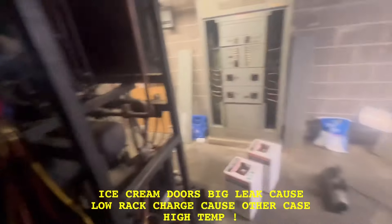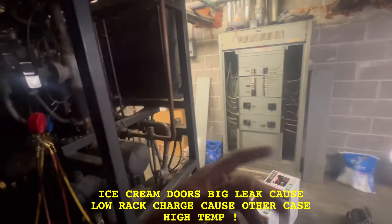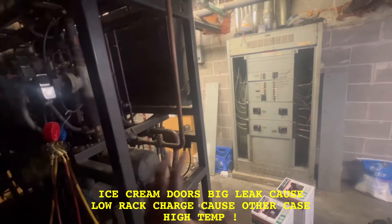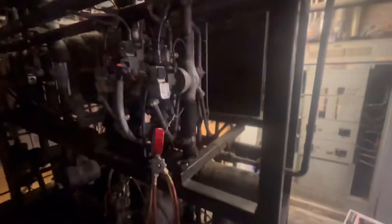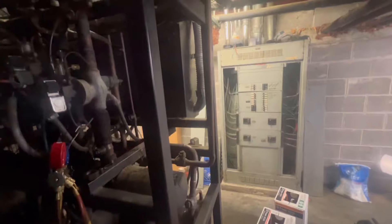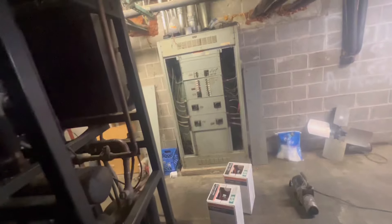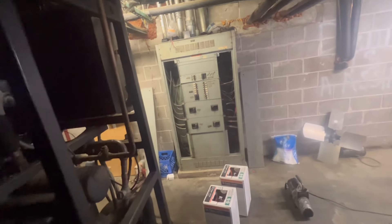I charged my phone temporarily. I found that big leak down there and welded up the lines. I isolated that case — the other case on the same circuit is still running. We're gonna end up pulling that whole evaporator coil. You can hear the water and all that bubbling when I put it in defrost. I just got some gas from a distribution company at Bakers, so I'm gonna add these two cylinders and call it a night.